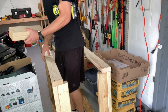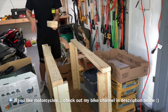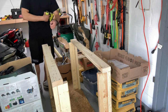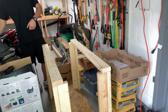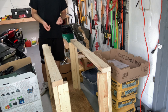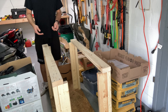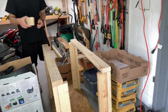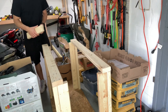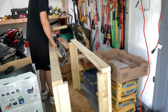All right guys, now that we've got our two front and back leg assemblies and the tops done — as you saw me kind of struggle through that — a lot of this stuff, anytime you're building anything, it's all preparation. I'm not really preparing here, I'm just kind of going on the fly today, but it's working out so far. This next part — make sure you're on a nice level surface. You can see me struggling with the driveway not being level. If you're doing this on a flat floor it helps a lot, and just constantly feel that the wood is flush.